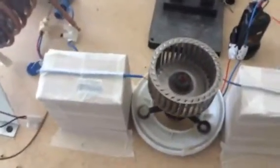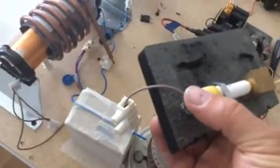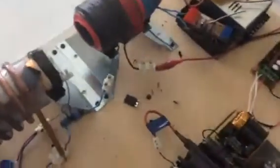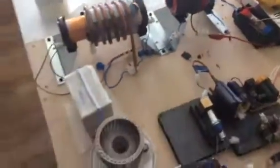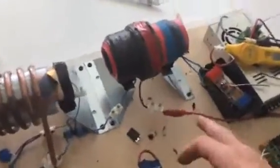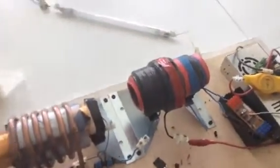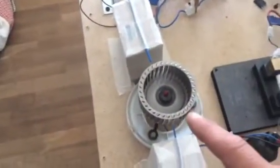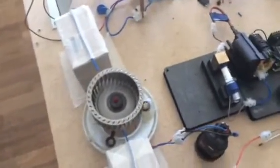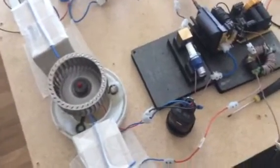So that was what I talked about before with this spark plug — I was tapping it on and off, which was giving quite a large spike. So the next thing is to see if I can collect the spark or the spike. I may need a motor controller on this, as we're a little bit too fast at the moment. That could do with another pulse width modulator.